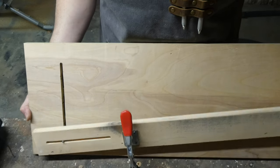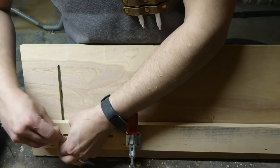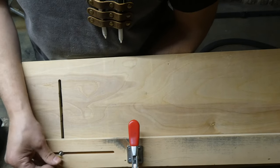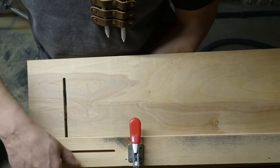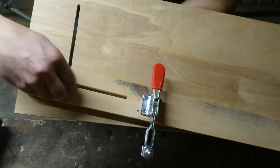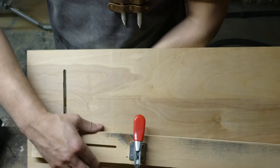Now the fun part. To attach the arm to the base, I pushed a 1/4-inch machine screw through and then screwed on an old knob I had laying around. This helped tighten down the arm to the base so when running through the saw, the jig won't move. I will be honest here again. After filming, I swapped the wood knobs for some real through knobs. I'll leave a link for those below. It just makes the jig look, well, sexier.